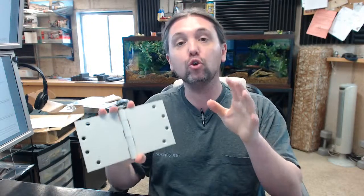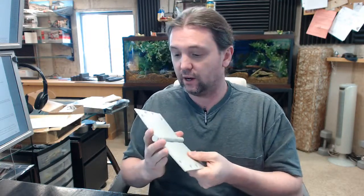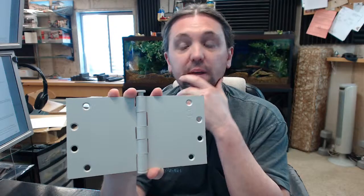And really where you're going to use a hinge like this is when you have an unusually thick amount of casing or brick mold or some sort of treatment on the pull side of the door attached to the frame, that when the door opens up, it needs to actually get out and around so that it can go flush to the face of the wall. If your door is only going to open 90 degrees, then you do not need to get around that unusual treatment to the wall, you might have shutters, let's say, installed. Then a wide throw hinge may not be so important.